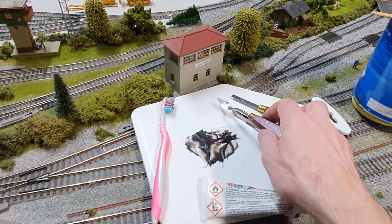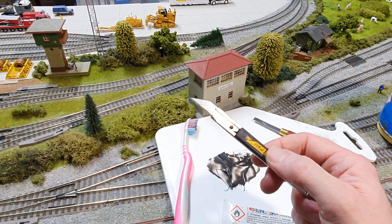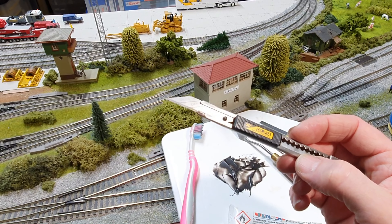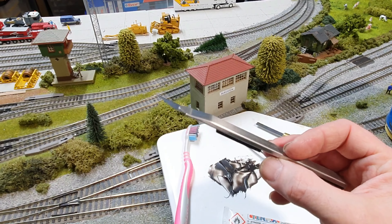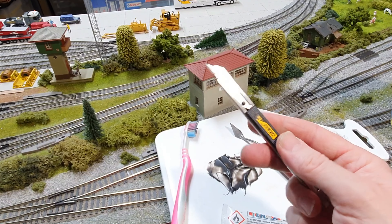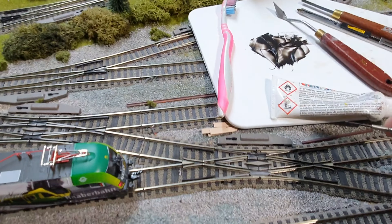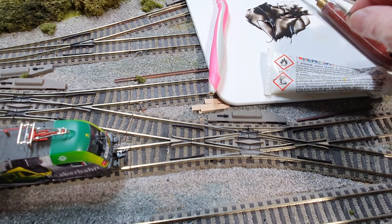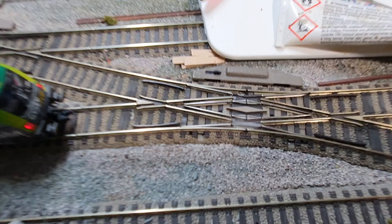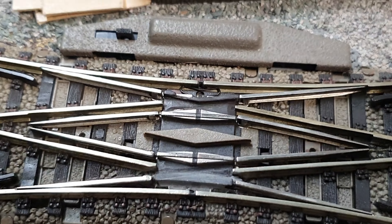I made a cast and used tools to manipulate the resin carefully into the joints. I used a 30-degree blade to carve it away — an Olfa knife. It's a really highly specialized Japanese-technology blade system and these are really really good. There's a 45-degree angle version as well. I cleaned all the double slips up first using small screwdrivers and a toothbrush with cleaning fluid. The cast worked out quite nicely. You can see one side where I've done it on the lower section, and then the top section where it's worn away completely.